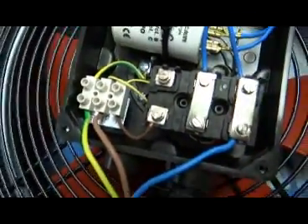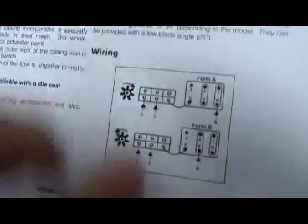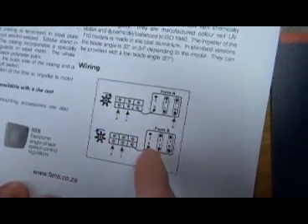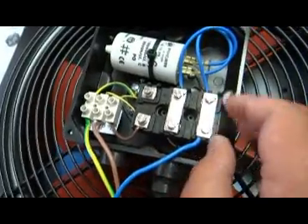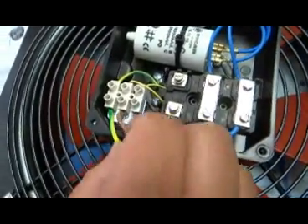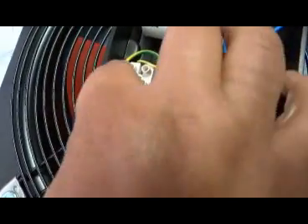To quickly recap: your links are connected between X, Y and W, and your next link is between X and V. Then there is a separate wire link from the first TP on your right to U. You bring your cable in via the gland through the connection box. Your neutral goes onto the furthest right-hand connection where the link is between Y and W. Your line goes into the middle TP. And furthest to your left is the connection point for your Earth.